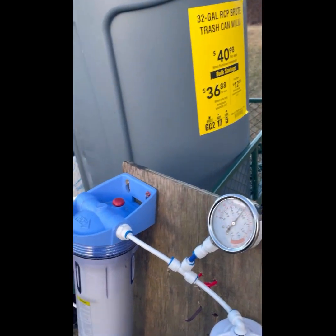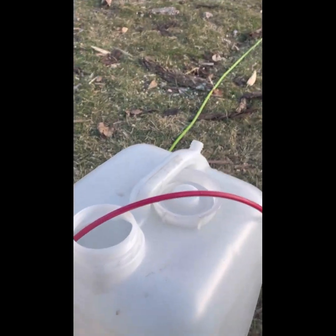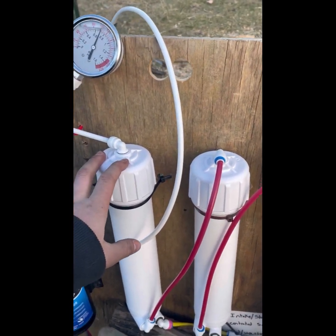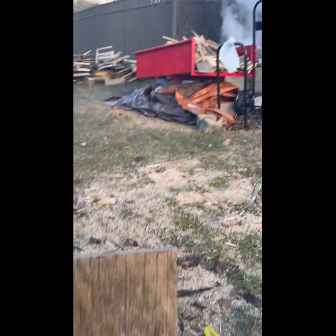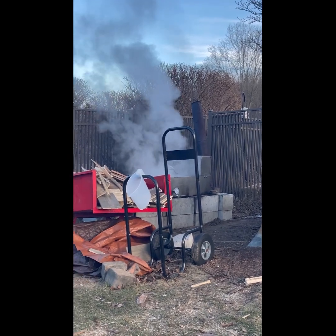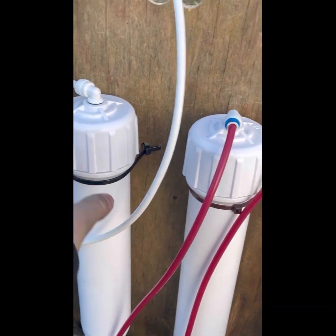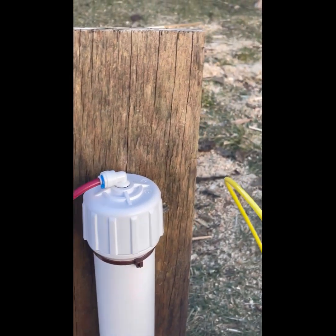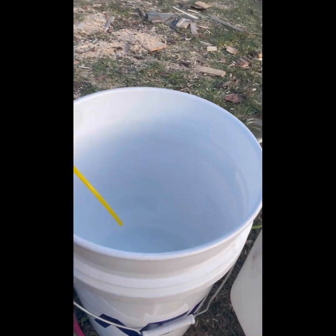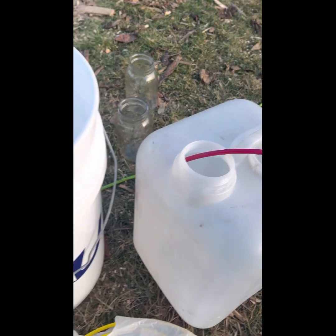So let's say I have 10 gallons in there — I can bring that down to 5 gallons, and that 5 gallons will still make the same amount of syrup as the 10 gallons. Because all this machine is doing is pulling out some of the water, just like that steam evaporating over there. These filters are removing the water, so to speak, so you have pure RO water and then you have concentrated sap.